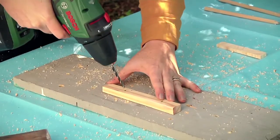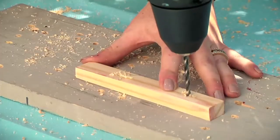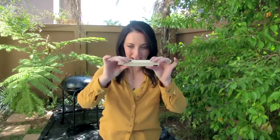Let's chat about the handle. It had a wood handle so I'm just going to keep it the same but replace it with new wood. I've marked out where my pilot holes should be — I'm going to do two shallow pilot holes and then use a wood screw on either side to screw the two together so that the metal pieces are nicely squeezed in the centre for easy handling.